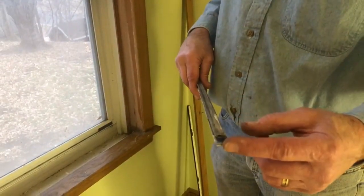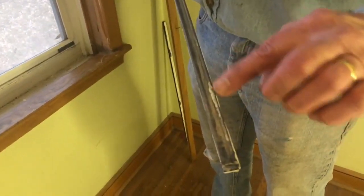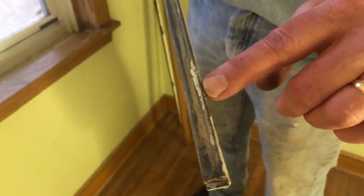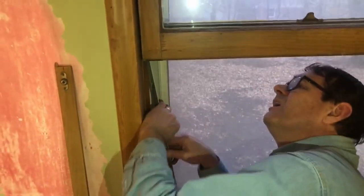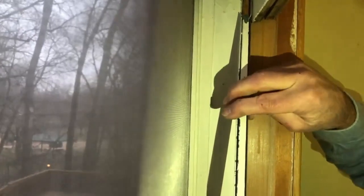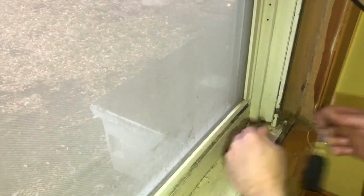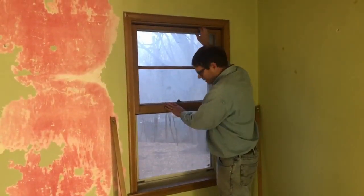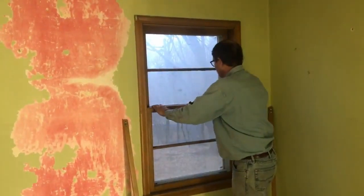Remember the parting strip has these two pieces of bent metal and a hole on the bottom. I'm looking for the piece that has never been painted — that's going to go to the inside of the room. Painted? Not painted. Now I'm taking the groove in the parting strip and inserting it into the metal piece of the window. You need to get it in there kind of tight and straight, then slide it up — it's a little tight. Now everything works out and this should slide easily down, though it's still a little tight because of all the metal-to-metal contact. But there it is, replaced.